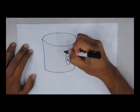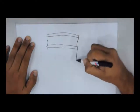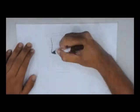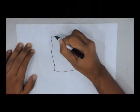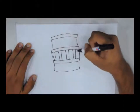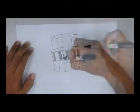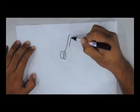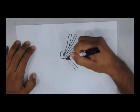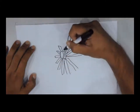Start with the wheel. First, for the axis of the wheel, a block of a tembusu tree trunk is shaped according to the desired shape like this. The shaped block is reinforced with metal rings and with holes to hold the spokes of the wheel. The spokes would then be inserted one by one into the axis before having its rim placed.